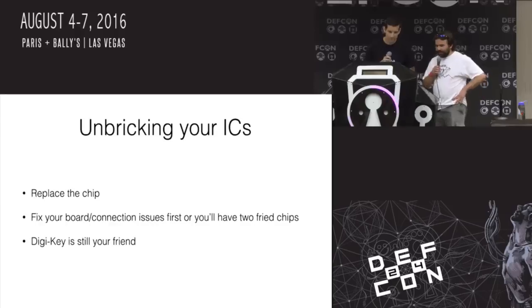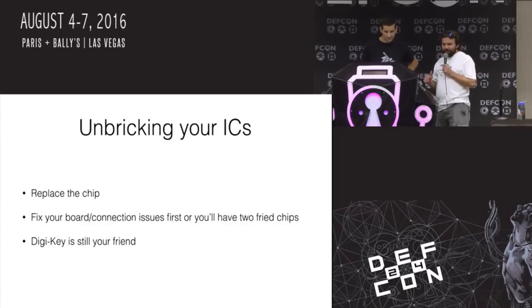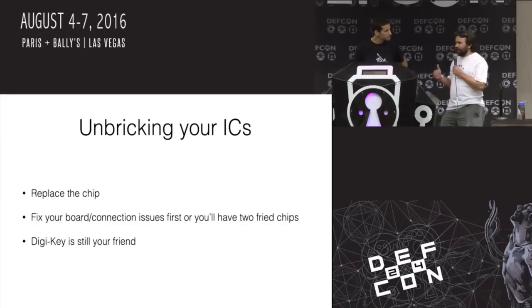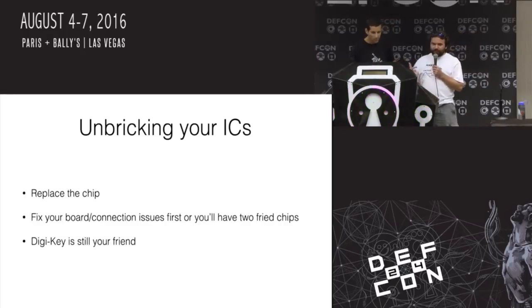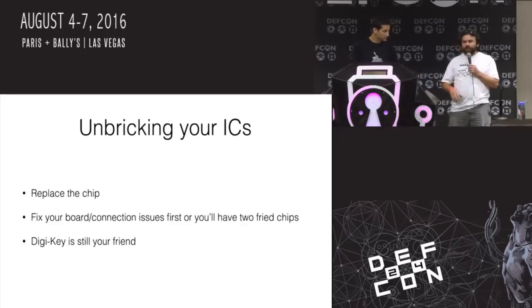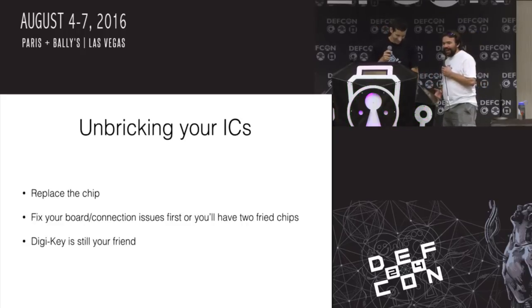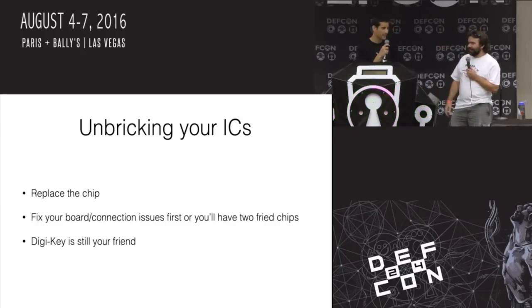He went in and very quickly realized there was damage on the physical die — an integrated circuit is really like a circuit board at a microscopic level. There was damage because the way the system was designed, there was current flow to a giant thermal tab, but that tab wasn't designed to handle current flow — it was mostly designed for thermal heat dissipation. So maybe it was a designer error, or they swapped it in, or it was just an under-designed part relying on the engineer to read the data sheet before actually designing the board.